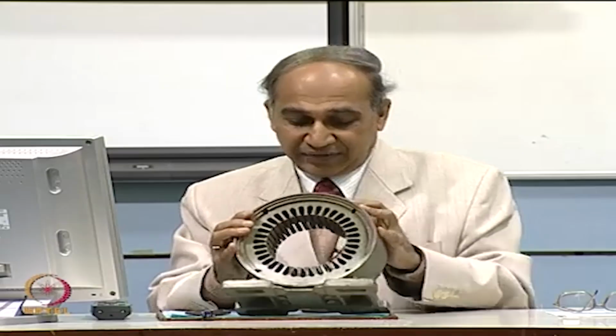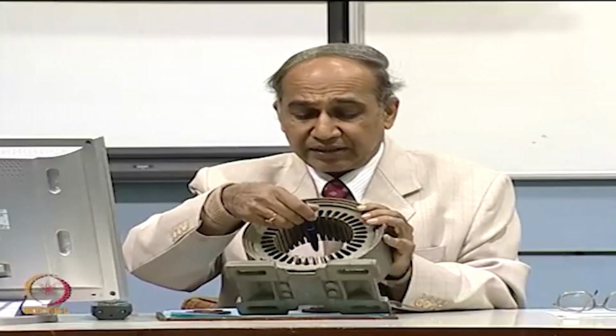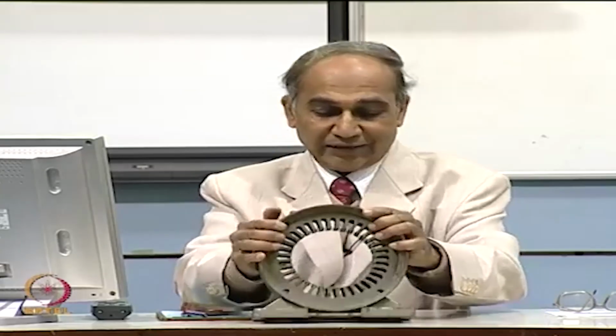So, the thing is, if you have a center of the shaft here, then from there to the base plate, that is, in millimeters, is the frame number. So, 112 means the center of the shaft to the base is 112 millimeters. They are practical engineering facts you need to know, and invariably they are not so clearly available in formal literature. They are engineering data, etc.